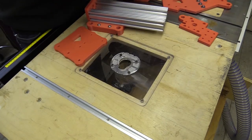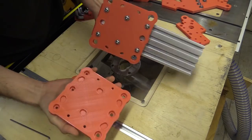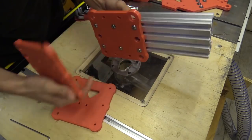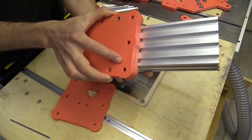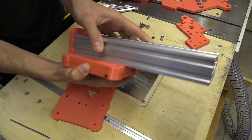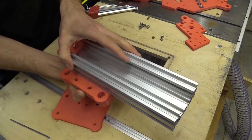But I'm not going to start with those yet. I'm going to actually start with the gantry. You can see the way I've designed these so that there's space for the heads of the machine screws that are holding the pivot plate onto the z-axis to move around. In fact you still get the exact same movement as you would when the machine screws are placed in position.